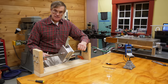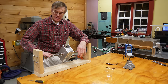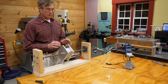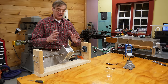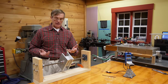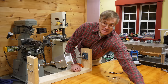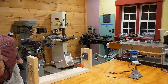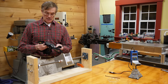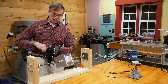A few pointers: stainless steel rod, stainless steel nuts, aluminum washers — everything around the magnet assembly is non-magnetic. The metal is kept at a distance so that nothing gets pulled down toward this very dangerous magnet. I could have done this in the lathe, but there are metal chips there that might be attracted, and a powerful magnet next to a big chunk of steel is a little sketchy. So it's a very simple assembly — you can put it together and take it apart when you want to. I'm going to throw on a couple of gloves, my son will hold the spool of wire, and we'll start feeding it around. Remember, the field in the gap started at about three quarters of a tesla, and we're going to see if adding a steel guideline for the field lines improves the strength.